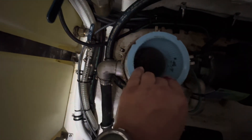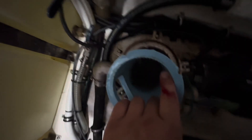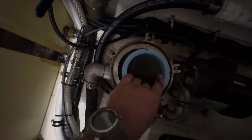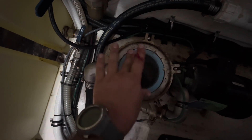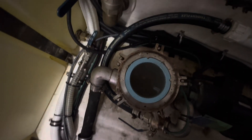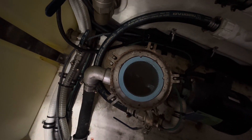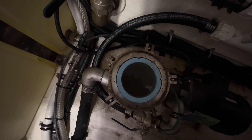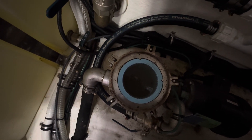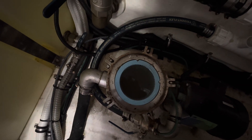It's due for an acid flush anyway — we're going to get that done here soon. But you see those two tabs right there? These two tabs simply drop into place like so. Now if that was really dirty, take it to the dock, get a wire brush or a bristle brush and hose it out real good, cleaning all those grains in the strainer. You want to get it as clean as possible — no algae on there, all that good stuff.